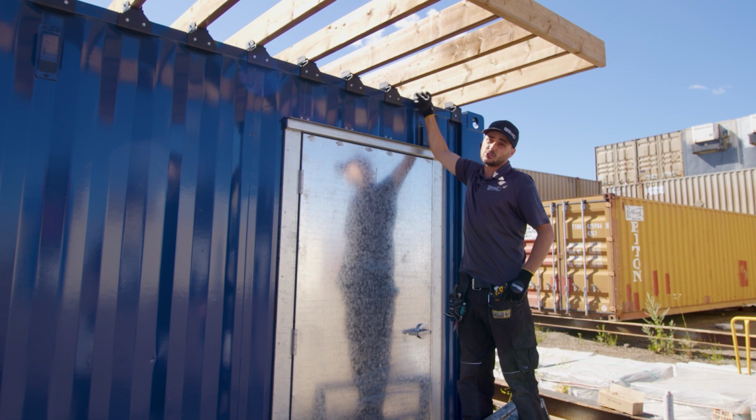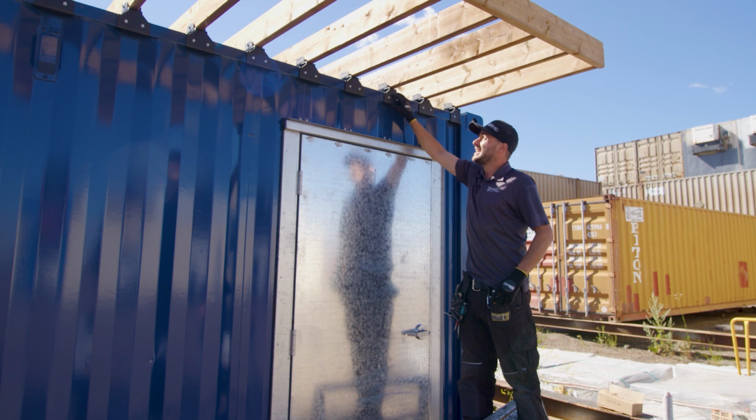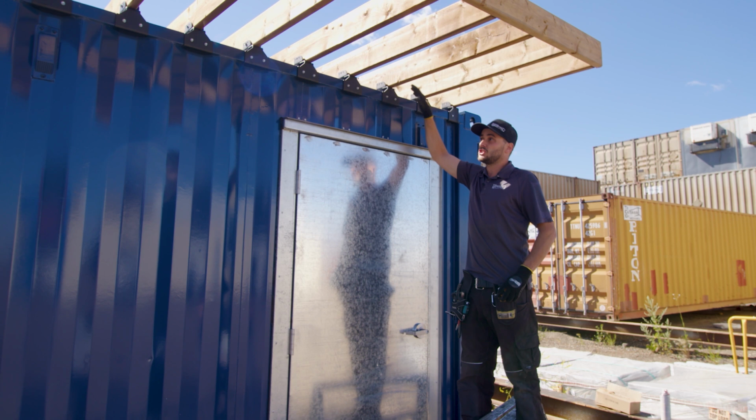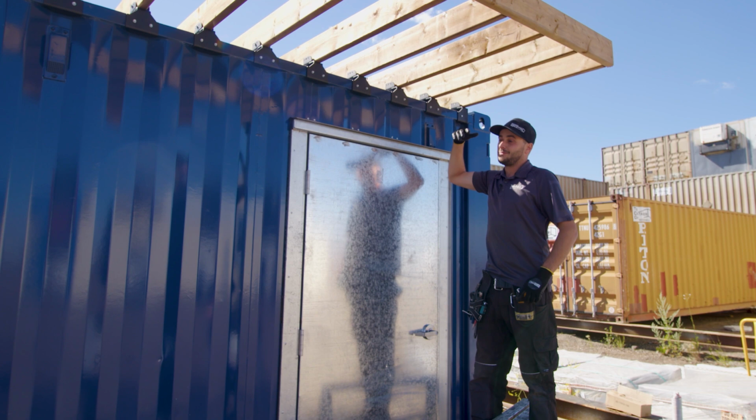So these things are very versatile, and they allow you to not puncture the envelope of your shipping container, and now structurally support something above on the roof of your container, not just placing things right on the roof corrugations, which are very squishy. You know, you dimple them even when you step on them. So this is the way to do it if you're looking to do something above, but not continuing another container above. That's what twist locks are for.